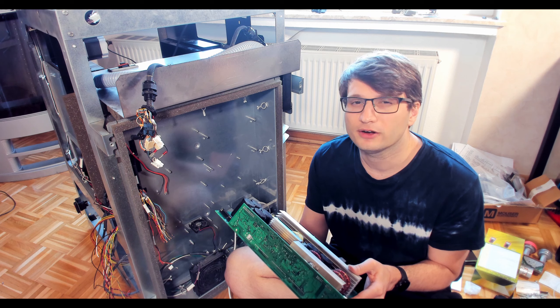The standoffs are very small and compact — exactly what I need for this application. The kit already came with nuts and screws, so it was a good purchase. It's also a Raspberry Pi kit, so I can use them for the Raspberry Pi as well, which I already have on hand. I also got the connectors — this board uses JST PH connectors. They're very compact and I got a kit on Amazon. The worst part of the whole build, in my opinion, is that I need to crimp all the wires for these connectors.